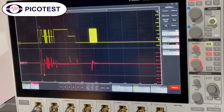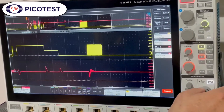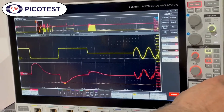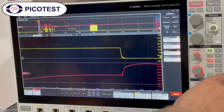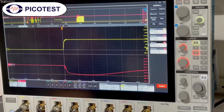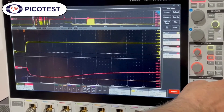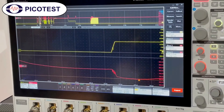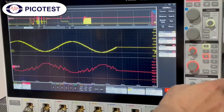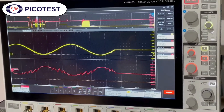In red, that's the voltage we're measuring on test points on a circuit board. Zooming in, you can see we're running quite fast, which allows us to synthesize almost any waveform we want. Here we have a synthesized exponential rise time — we can tell the controller what we want the time constant of that rise and fall time to be. If you didn't like exponentials, there's also linear rise and fall. For FFT measurements, we can do sine waves — 2,000-amp sine waves up to about 10 megahertz with this load.